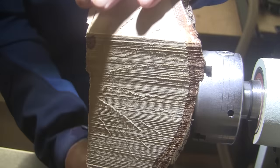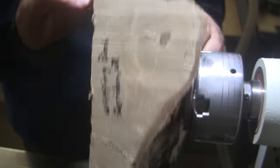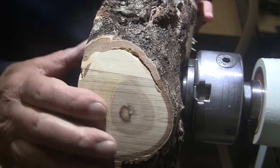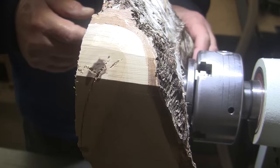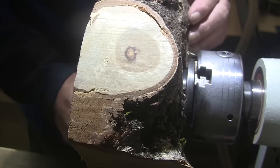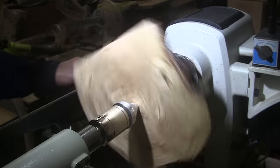For the past few turnings I've given the OCD crowd some concern with all the square corners — and I count myself among them, though my OCD has to do with three-way switches and making sure I've turned things off. So I'm going to round it up, partly just because I want to on this one. This will be a round bowl; there are all kinds of irregularities on top and we're going to leave the bark on. I'll start by rounding it up using tailstock support, spinning the piece up a little and letting the live center find its own hole — a little thing, but it means a lot.